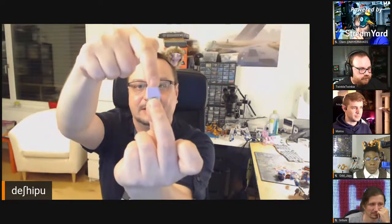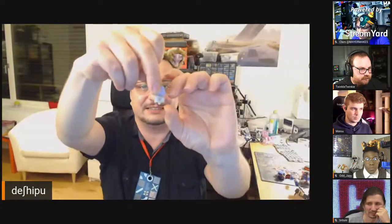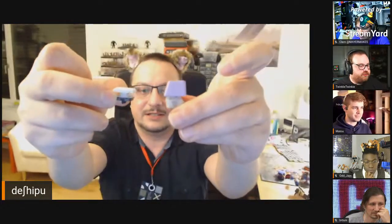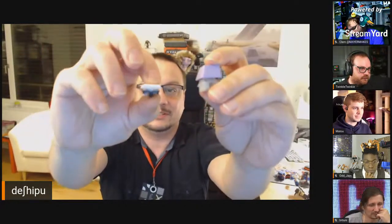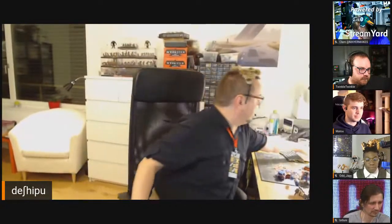So a mechanical switch looks like this. You can see the keycap is a big part of it, and there is quite a lot of travel for the key. And also there is quite a bit of unnecessary space wasted here. So 2 years ago, I found out about the Kailh low-profile mechanical switches, which look like this for comparison. Nice. Yeah, so this has 3 millimeters of travel, and the keycap is much smaller, and the switch itself is much smaller. So the idea I had was to build the flattest keyboard I can make that is still mechanical.